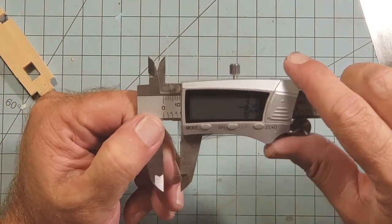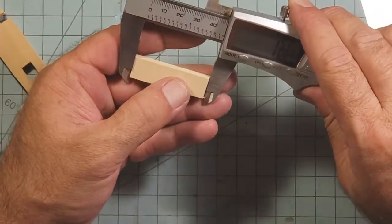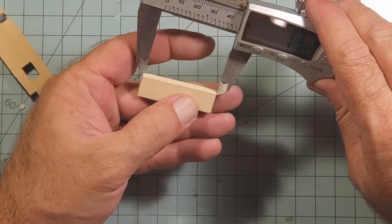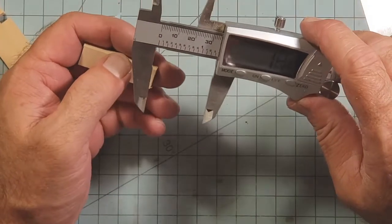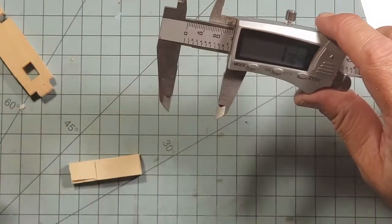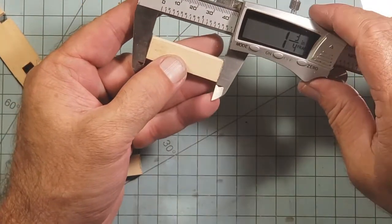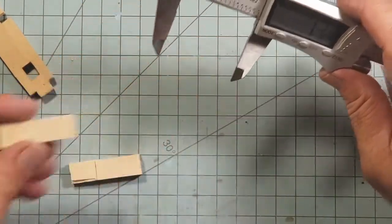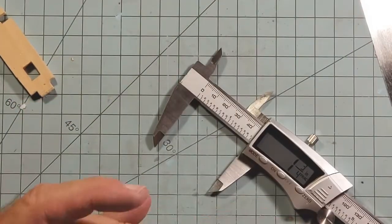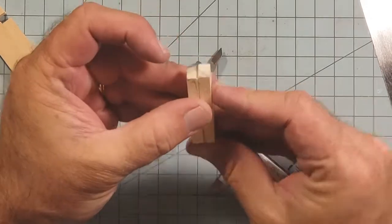What I'm doing right now is figuring out — I need a 3/8-inch by 1/4-inch hole in the center of that piece, so I'm measuring it. It's supposed to be 1 and 3/4 inches wide, which that one was, but the first one was a little bit smaller. So I'm going to have to adjust it to the size of the smaller one. I wasn't going to cut another piece of wood, so I just made the bigger one a little bit smaller.